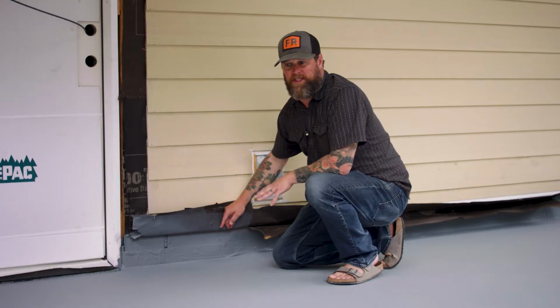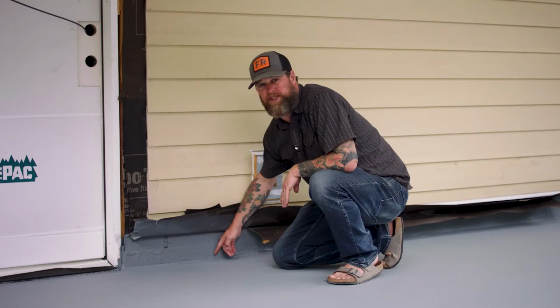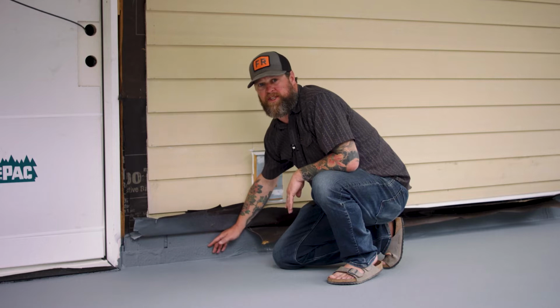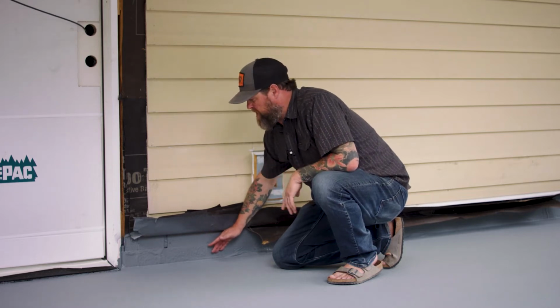One of the most important details about deck waterproofing, the wall to deck joint. If we're doing a seamless waterproof deck, you gotta take care of the most important seam, the one that's in contact with your house. So we go up the wall 4 to 6 inches, depending upon what kind of room we have. And then a belly band's going back over the top of it.